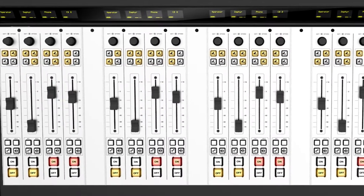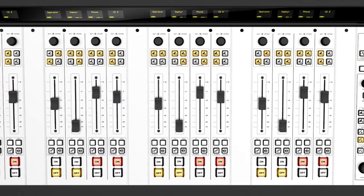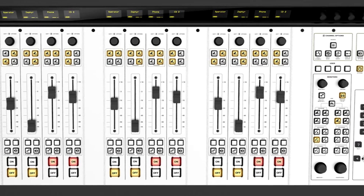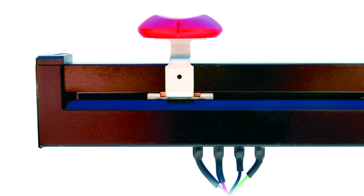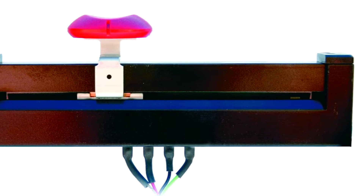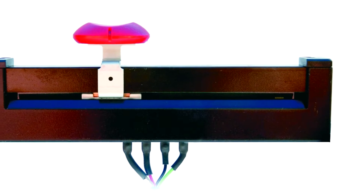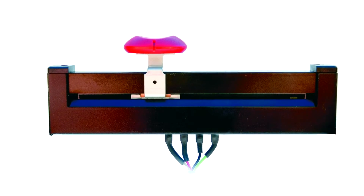Some of the most important parts of any console are the faders. One of the reasons faders fail is from dirt, grime, and of course liquid that falls through the slots in the modules. Fusion's faders are special premium conductive plastic faders that actuate from the side, not the top. That way, dirt that falls through the surface slots falls past the faders, not into them — so they stay smooth and silky nearly forever. That's a fast look at how Fusion consoles are designed to last and built to perform just as beautifully as they look.